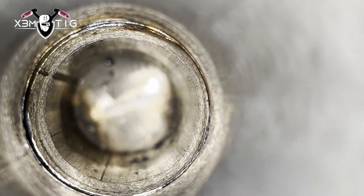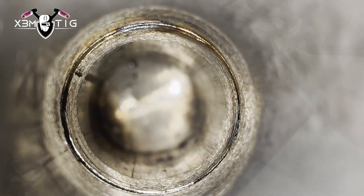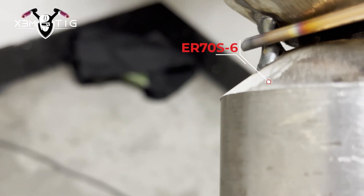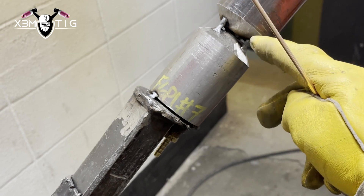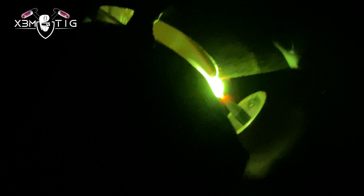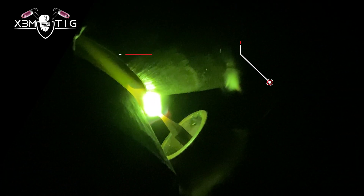Always check inside for any high-lows before you start welding. You have lots of time, no need to rush. The idea here is to stop only two times — that's why I set up tacks at three, six, and twelve and nine o'clock. Only two stops: one on this side and one on that side. When I come up to that tack, I'm just going to cut it out. Filler wire is a 70S-6 and I'm running 110 amps on this one.